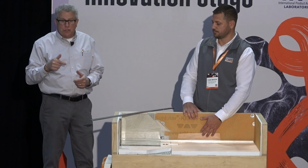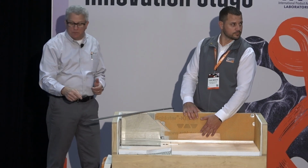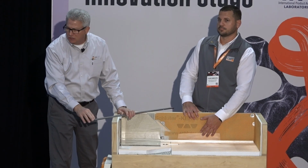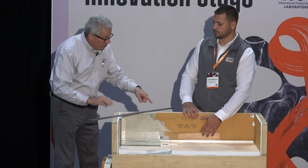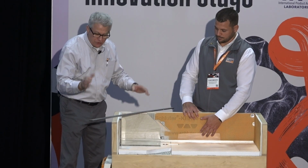We import those from Germany because they are a non-bluing blade when you use those to cut these things, which means, if you know anything about the metal, when it gets superheated, it'll actually start to turn that blue color from the heat, and this blade won't allow that. So you can actually use those to cut this to fit. This piece just fits in between your tile or wall-to-wall and tile on top of it, your option.